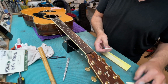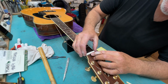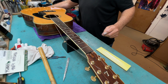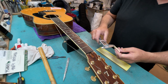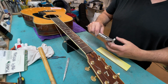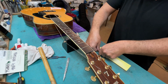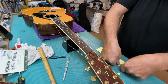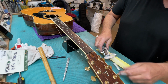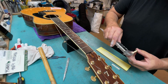Now what I'm hoping is this will give us a fairly instant drop-in fit, which is actually a fraction wider than it needs to be, and we can double check these things. Don't take the visual word for it. We'll check with our machinery. So 4.94, and this will be about just over 5, won't it? Yeah, 5.01. So I'll carry on taking this down a little bit with the fine paper on the brass block, and we'll basically want to do it until we get to the same as this. It will fit inside this little lip of finish there, so we want it to sit inside that.